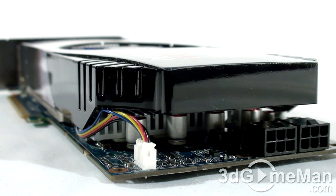The maximum power consumption is 188 watts at max load and 27 watts at idle. So a quality power supply that can handle the load is very crucial, especially in a multiple video card CrossFire configuration.